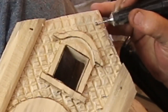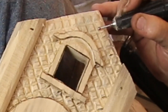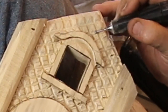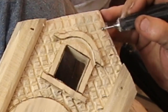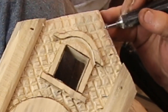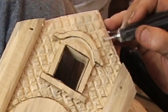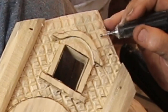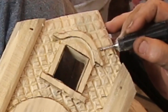I've switched to a ball diamond bit, and what I'm doing at this point is rounding over the corners a little bit, down into the pocket, making that more of a button. And this is just the preliminary. I'm not gonna film the whole Magilla for you guys, that would drive you insane. But this will give you an idea. It's starting to take shape on the faceplate of this thing.